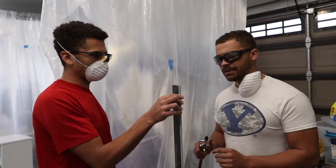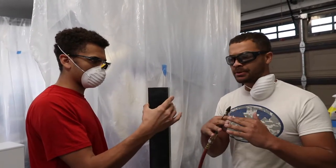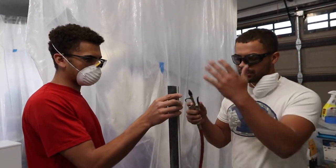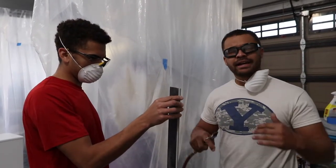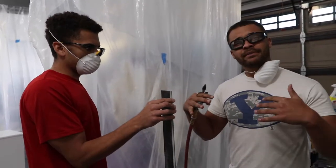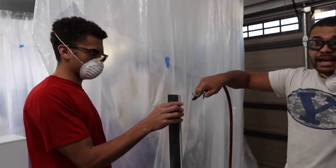Just off the table saw — you do not want any debris in the tongues of these planks because they will not snap together properly and they'll ripple and break. If you have an air compressor, use it to blow off the boards and get down into the grooves. If you have a vacuum, that works too. People have a hard time getting these to lock because a little chunk gets stuck in there, so make sure to clean these out and wear eye protection.